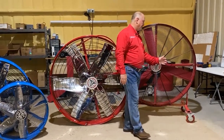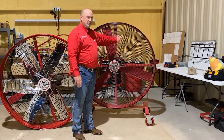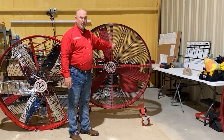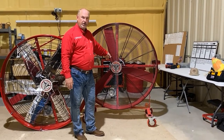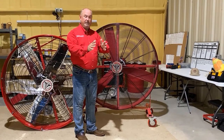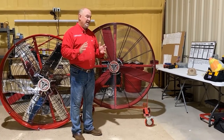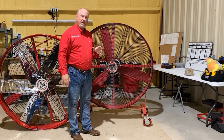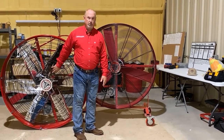We do have one other fan model — our floor fan. It's the same as the 5-series fans but it's got wheels on it. It also has an OSHA-compliant grate on the front and back so children can't get their fingers in it and it won't pick up debris through the blades. We have our red blade set on it. We wanted an option where instead of the funnel-shape airflow, it blows straight for long distances — like robotic warehouses, production lines, aisles in inventory warehouses. The red blade set is a different design and sits further back in the shroud to give you that long, skinny airflow.